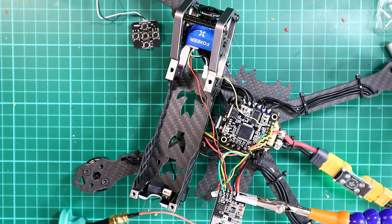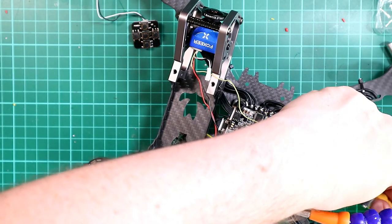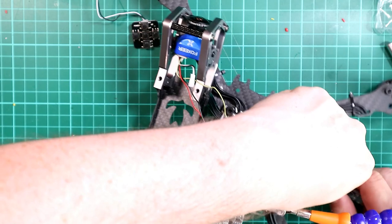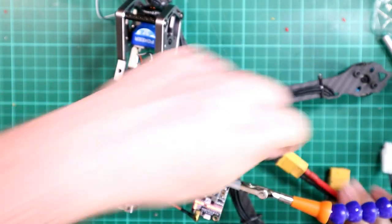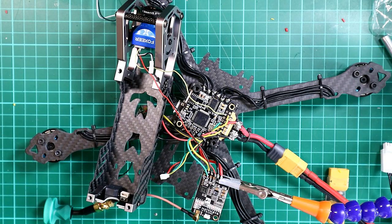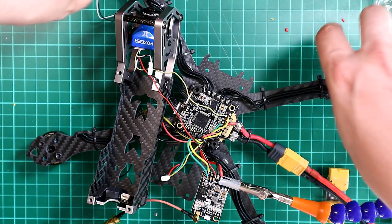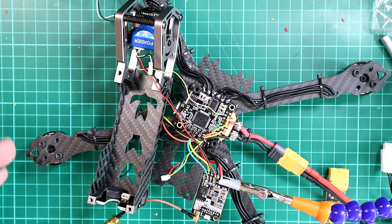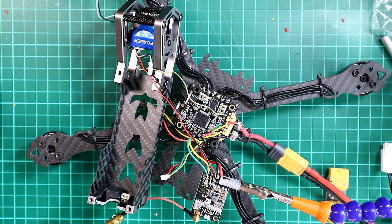Video transmitter's on. I've got a signal — as you can see, that all seems to be working. My camera's working, I can see that. The flight controller's fired up as well — I need to remove the OSD menu off this, but at the moment we have video working, we have motors that seem to be okay, we've got a camera that's working, and a transmitter that is currently lit up. The rear lights aren't working as I've plugged them in, but I've tested those before so that seems to be okay. So that's how you connect everything up.